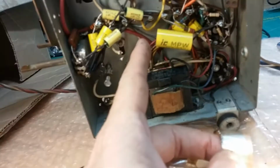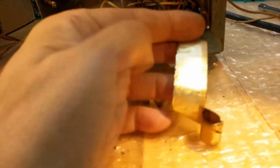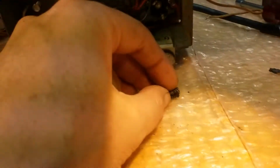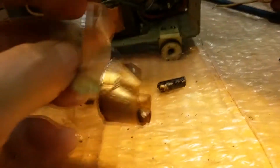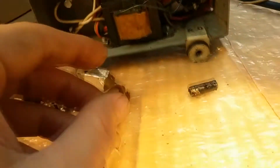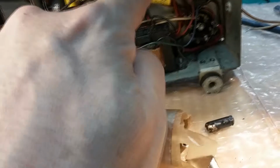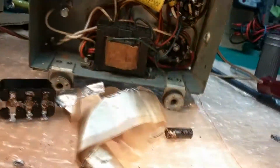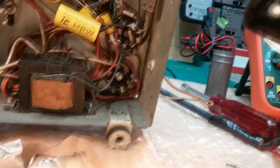And that's why capacitors have to be with the negative side facing the negative end of the circuit, because the negative side is not just the lead, but it's also the outside of the roll, this outer edge of the roll. And so that's like a big antenna, right? That's just a big old aluminum antenna picking up all kinds of noise. So you definitely want all the noise that it picks up going right to the ground side, and sucked off, so it doesn't get in and amplified in the circuit. But a lot of people just flip these in any way they want, and you don't want to do that. You got to get an oscilloscope and find out how they go.